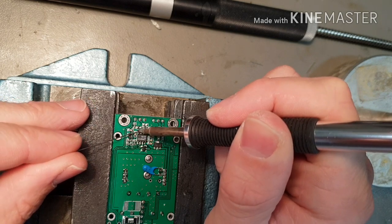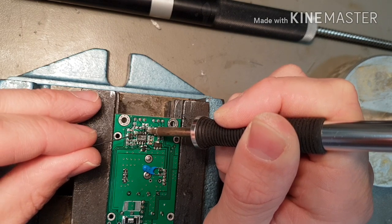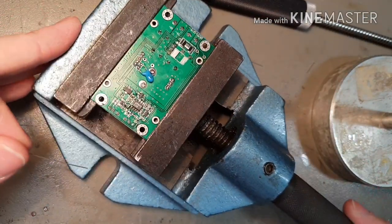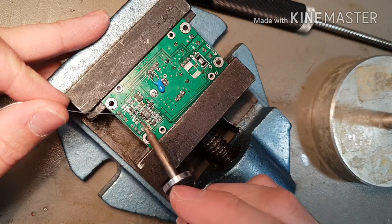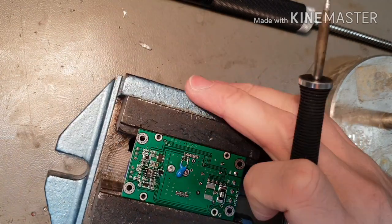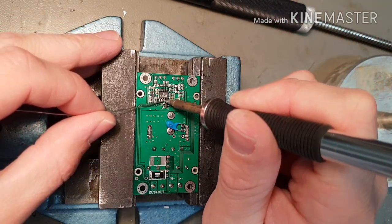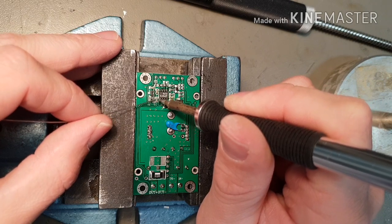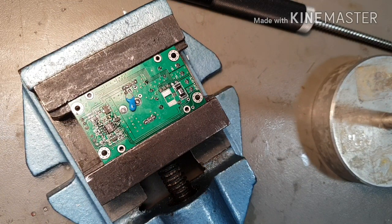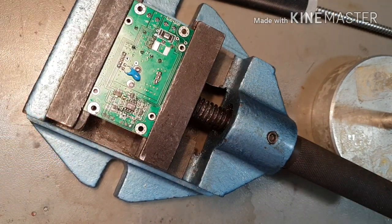And this is why I hate the soldering iron. It hasn't got the precision you need, or the heat where you need it, right in the tip. It's beefy, it can heat a ground plane in seconds, but it hasn't got the actual precision you need for this kind of work. And there are soldering irons out there which can do both. I've used a JBC soldering station and I've used a Weller soldering station. They're really flagship ones, which are both actually cheaper than this Metcal, and they both do a much better job with the precision work, and I find they're just as good at the high power stuff, so I'm not a fan of the Metcal.